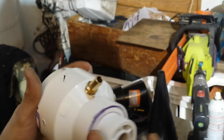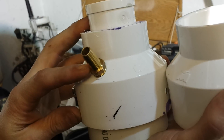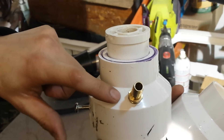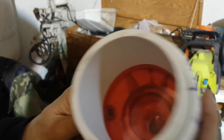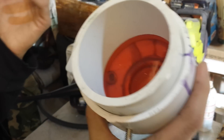So that covers that. The next thing you want to do is on your 2x3 piece — a lot of guys run these through here, which is way too much drilling to go through. So it's much easier if you run them through this 45-degree angle part. All I do is drill it out and force thread this little nipple in here, and that's it. Any type of sealer with that? Nope, just run it through. It'll seal itself because you're force threading it into PVC — once you drive it in there, there's no problem.